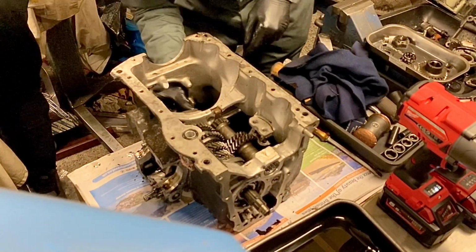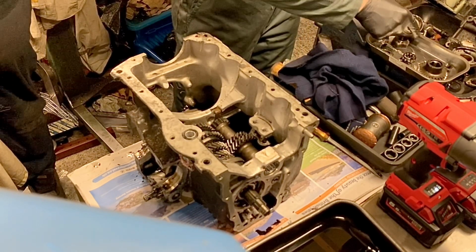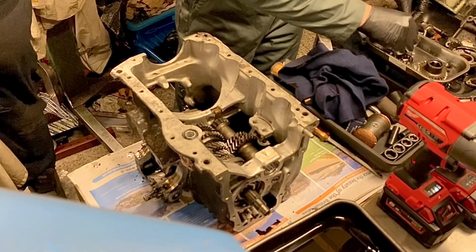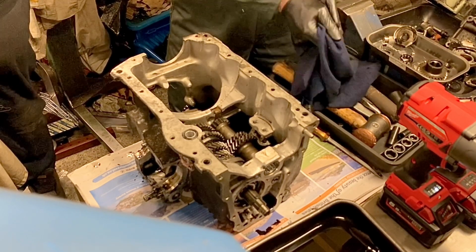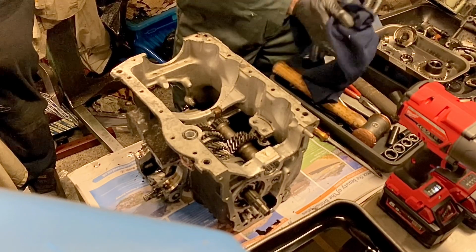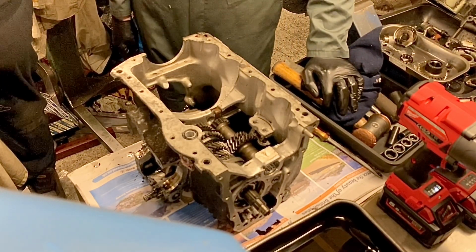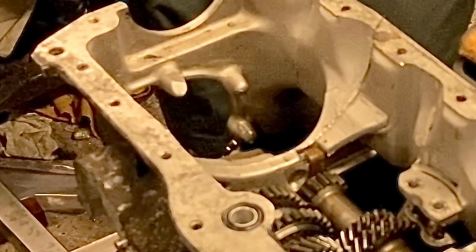Beast. If you didn't have that nut gun, I've got a 4-foot breaker bar which I use for getting them off. So they're easy to get off when you use the right tools, but don't mess around with a 2-foot breaker bar, because sometimes you'll be there for a long time. That's an 1898 Newton meter impact wrench, so you need something manly to get them off.